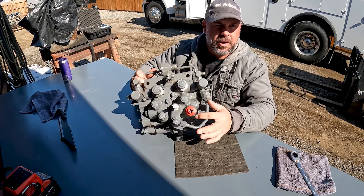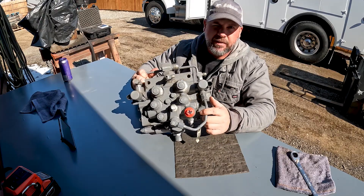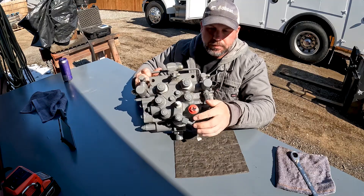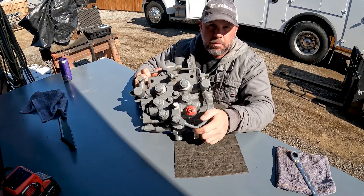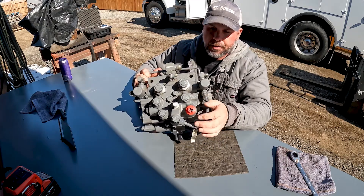Charge pressure on this machine is probably over 400 PSI. He's got a T590, so let's say around 430 PSI flowing down to the brake coil. And if it has two-speed, it goes down to the brake and two-speed block.